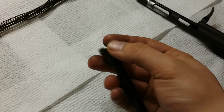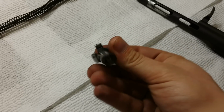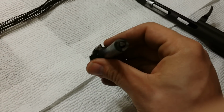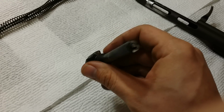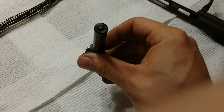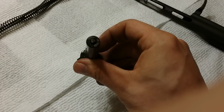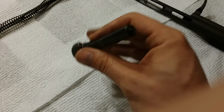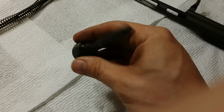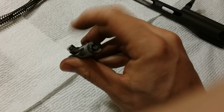It is kind of gouged here. We talked about pitted metal and stuff before. That has continued. After this last range session, many of these surfaces actually took on a highly polished appearance, which in and of itself is not such a big deal, but definitely shows us where it's getting wear. You can see here, this is another locking surface, and it's getting chipped up too. That's not metal to metal brush wear. That's chipping. The metal is chipping on this locking surface and on that locking surface.